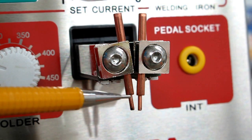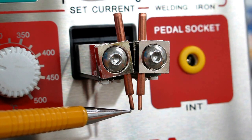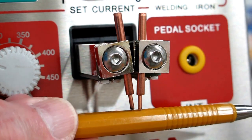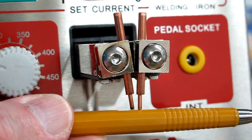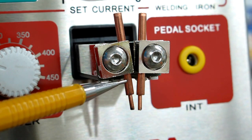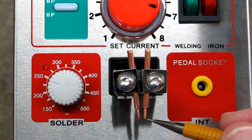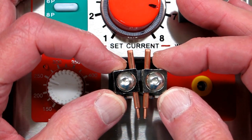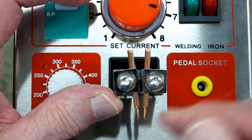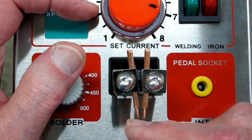These electrodes are consumables — you may want to order a few spares. When you see that flash, some of the electrode end is burned away. Practice pushing them on squarely and make sure you have contact with both before firing. If you have a lathe, you can dress them back — they're long enough to be dressed back several times. This head allows for some differential movement to compensate for uneven length or surface, but generally you should try to keep them as equal as possible.